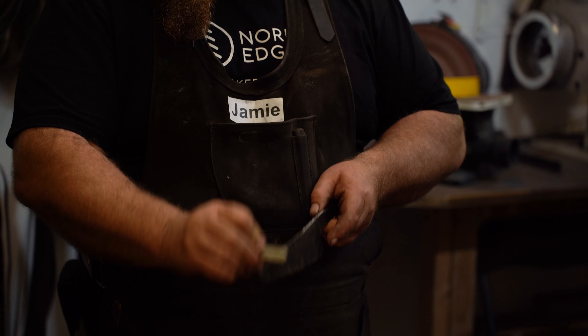We do it like this so that we can have leverage and be able to apply pressure. If I balance on the edge of the tool rest — there are bigger tool rests on there — find the longest sticks you can. Then I can replicate that exact same amount of pressure using the leverage of the stick. Some people want to push like that, but then all of a sudden you're on the back of your knuckles and your pressure might be different. You're always going to do left hand and right hand differently. So I take a step to the side and use my stick that way.